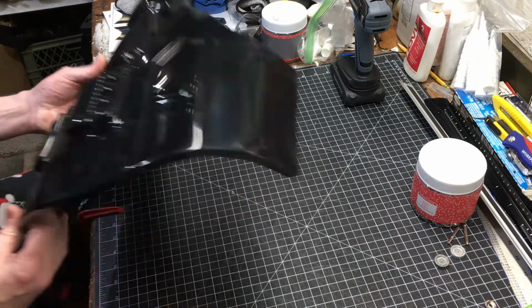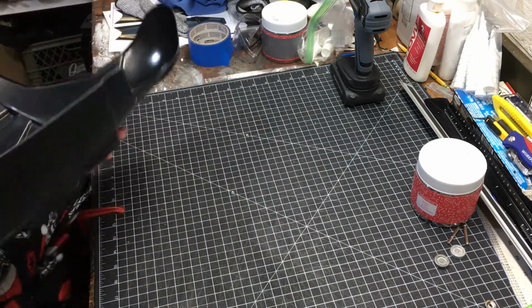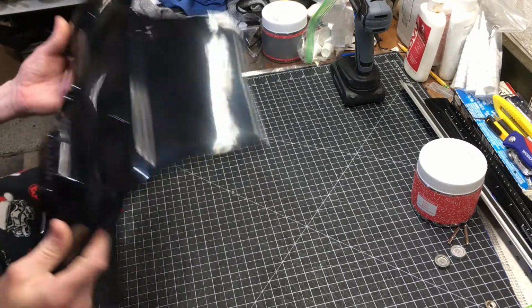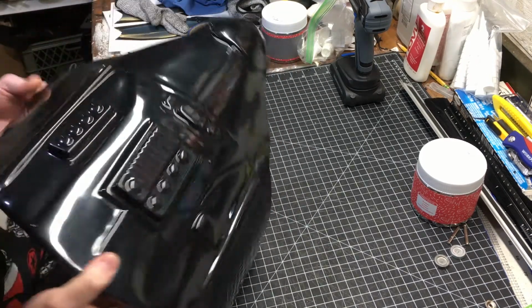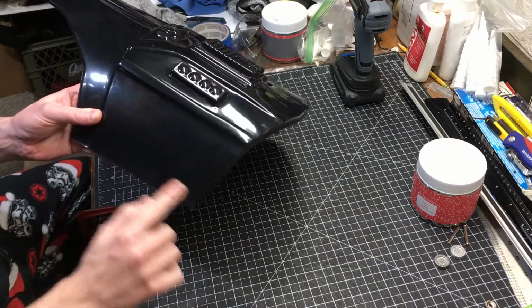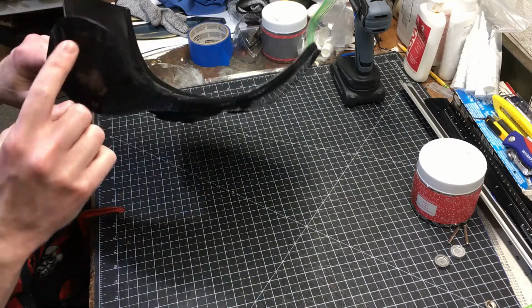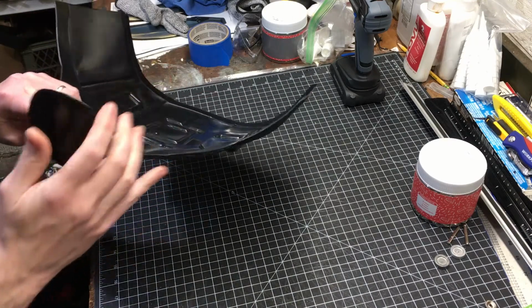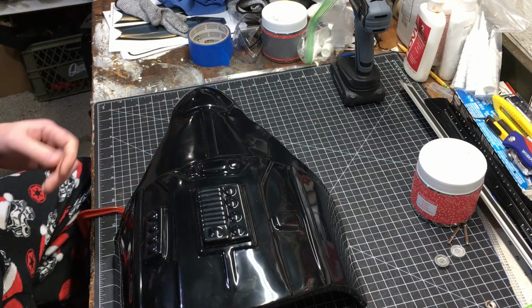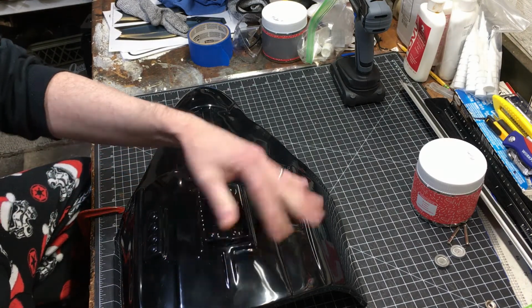Today in this episode, we're going to be doing a little more finishing work on the ab section and the back butt plate. There's still some holes we have to drill for some split rivets on the side here and on the bottom here where the front cod piece connects to the back. And we're going to start sizing this up for where we're going to put the pieces for the strapping.